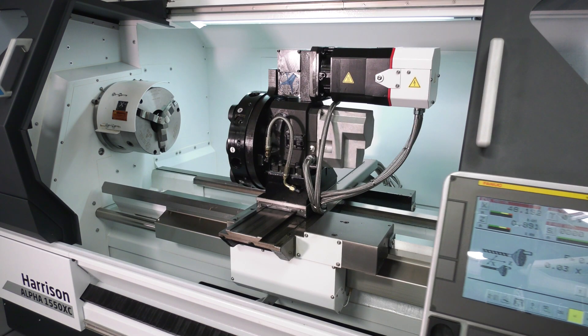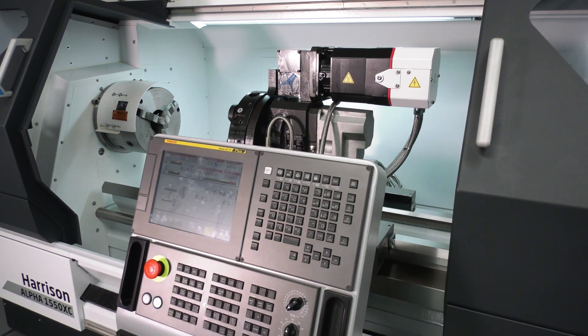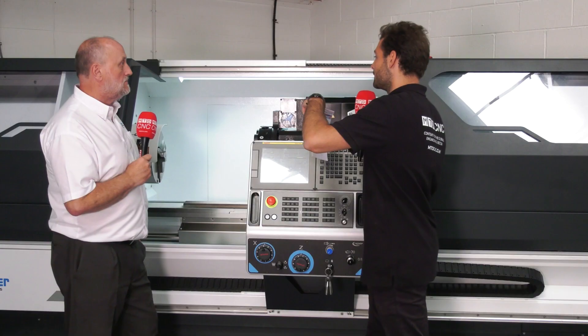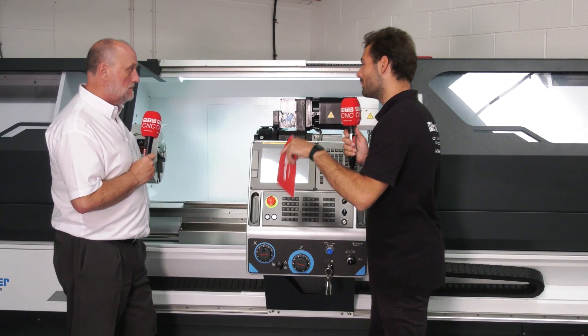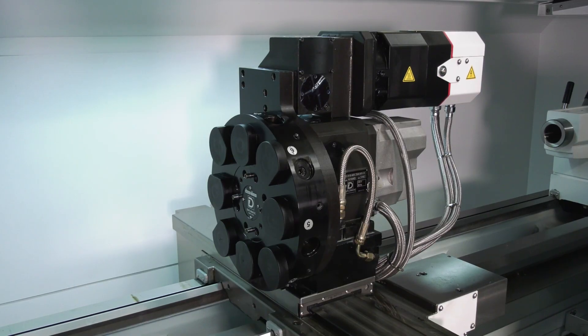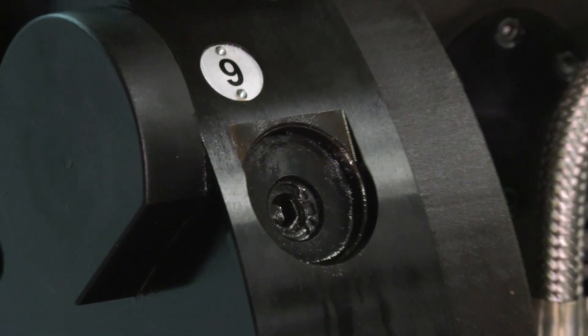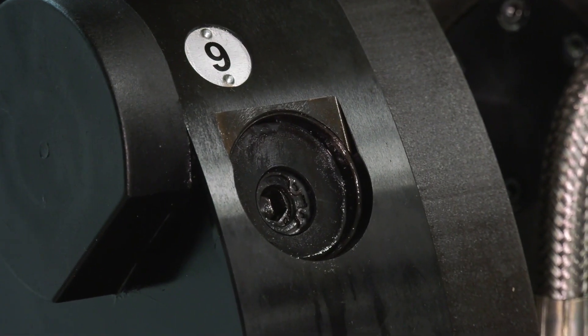You can use it manually and you can use it for CNC, and various options between that. You can have a standard two-axis system, but this is a three-axis — so what is that third axis and what can it do? The two-axis comes with a standard quick change tool post. We then remove that and replace it with an auto indexing turret, and in this case we put driven tools on that as well. With a C-axis it turns it into a three-axis lathe.